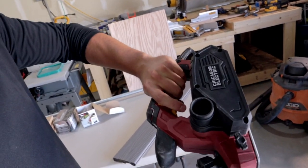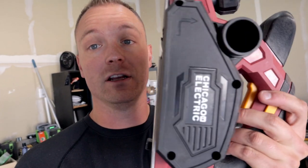Being the amateur that I am, I didn't replace the batteries in time and the camera went dead as I was planing down those beams. So to give you a quick rundown: I went to Harbor Freight and got a Chicago Electric cheap little planer — it did the job just fine. I went through the deck after framing was done and ran a four-foot level across it. Whenever the level hit a beam I knew that beam just had to be knocked down a little so it slid even across. I set my planer to a very low setting and just knocked off a little bit at a time. It only took an hour, but that little bit of time will save the entire look of the deck.